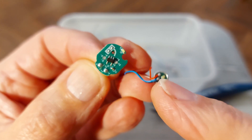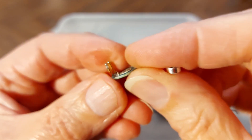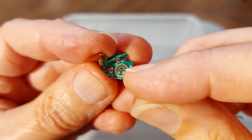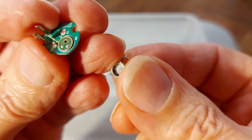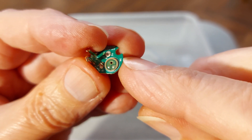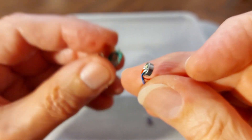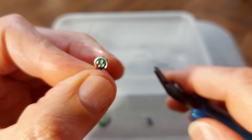I said that chip on the back was the one that does all the work. Well, it does, but normally it's actually inside the sensor. So I thought I'd better just check and have a look. I've ripped the cover off that sensor, and yeah, there's nothing inside there. It works on capacitance basically - the air pressure changes the little pad in there, and that makes contact and triggers the heater. Normally that chip is actually inside there, so I thought I'd just rip one of these apart and show you.